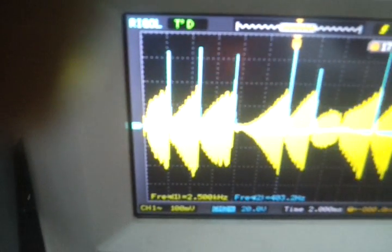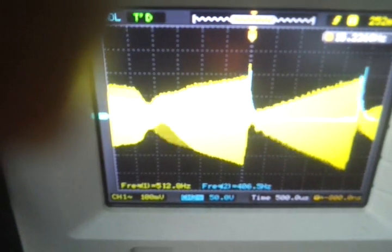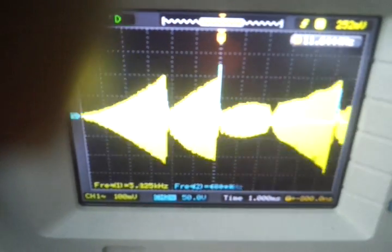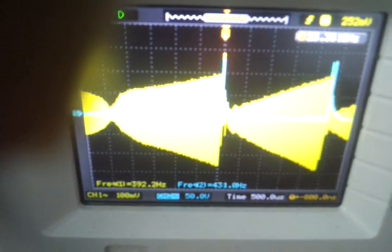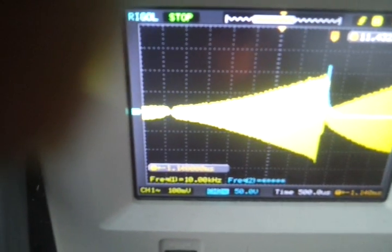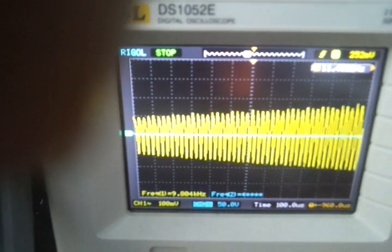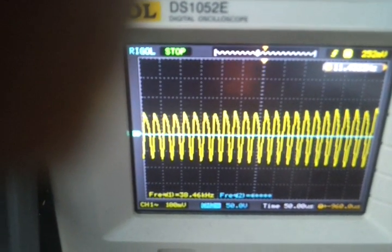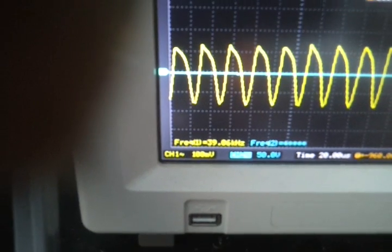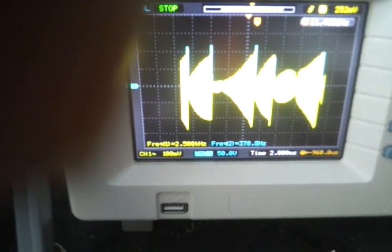Let me show you a little bit of detail. See, that's the rising waveform that you're looking for. And that's running at about 39 kHz — that's the output frequency of the NST.